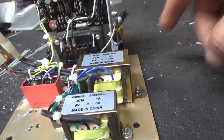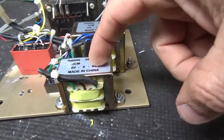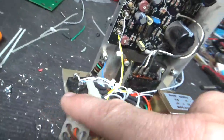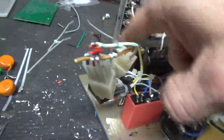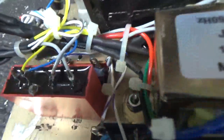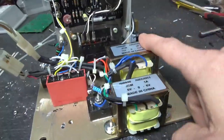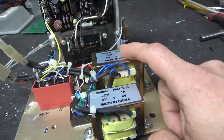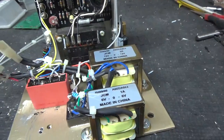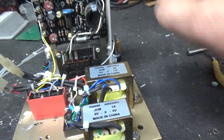This capacitor speeds up the relays. Using one half of this transformer — also starts off hot, so I'm using a series dropping resistor. The bleeder and cap across the rectifier. This powers the RJ-1A for the biasing and the RJ-1A for the input TR switching, and the two paralleled RJ-2Bs. And this powers the protection board.